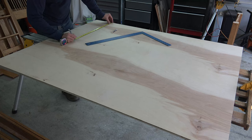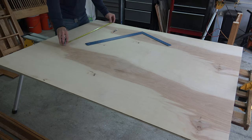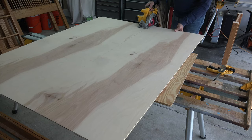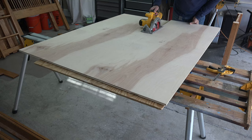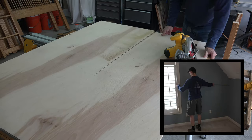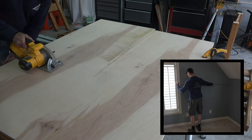Although the bunk bed wood is hard oak, I still feared that having no support in the middle at the elbow of the desk would allow for a slight bend. I doubt this will happen, but I bought a ply sheet to go under the desktop for extra support. In the end, I am glad I did this, as it helped out immensely when putting the boards on the top of the desk together. I just got lucky here. So with the measurements that I took at the beginning of this video, I cut my desktop to fit it.